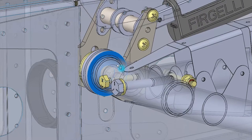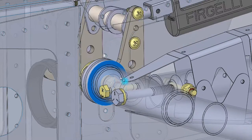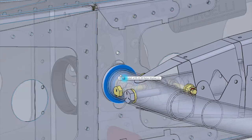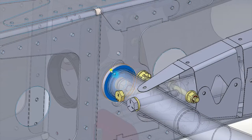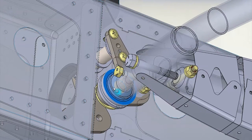The system is designed as a retrofit to the EMG-6 without stabilizer trim, and the trim position cams operate by moving two roller bearings, one bearing located on the cam arms and the other bearing operating as a guide along the slot in the side of the fuselage boom. In addition to the roller bearings, there are also nylon washers to provide a bearing surface on either side of the fuselage boom during operation.